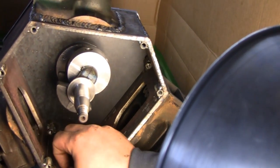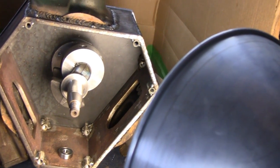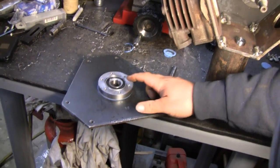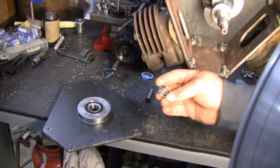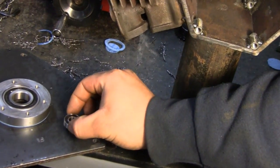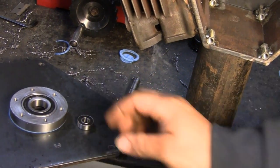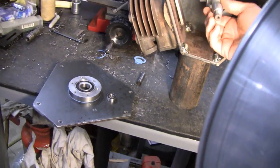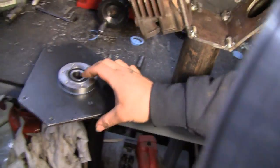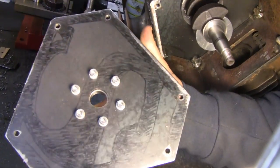That's Road King's job — he's in charge of cosmetics. So right now I'm working on the camshaft bearing carriers, which are going to be made out of aluminum. Similar concept with the main bearings, but this is one of the camshaft bearings and they're quite a bit smaller. I'm going to make those out of some aluminum I have over there on the lathe. Give them a look at that plate that you bolted on — they were all worried about that because we decided to bolt it instead of weld. I think it came out pretty well — real nice.